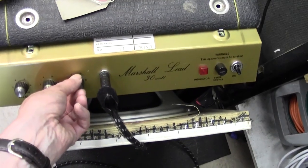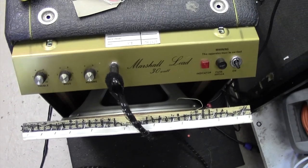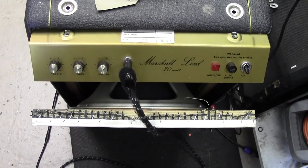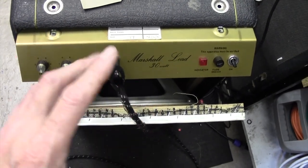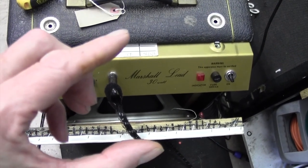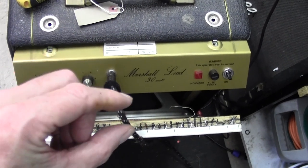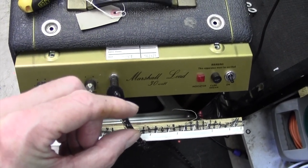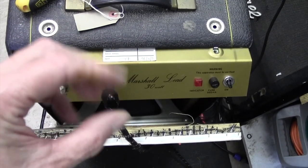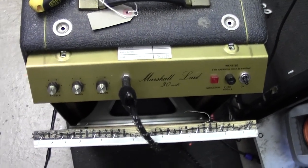That's interesting. So when I strummed the guitar, it put it into oscillation, basically. I'm wondering if that might actually be smoothing capacitors, and that as we put a big signal in, it demands a lot from the power supply. It can't cope, so the power supply collapses, you know, from 24 volts to 15 or something, and then comes back up again, then goes back down again, then goes back up again, and that's what you're hearing. That sound is the power supply oscillating effectively.